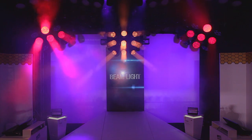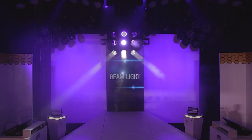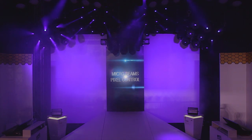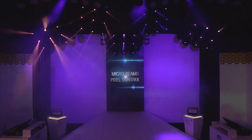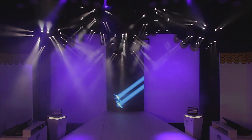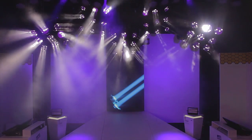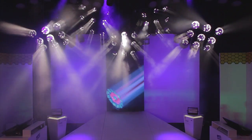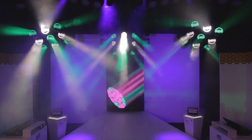However, the B-EYE is not just a wash light. When the beam angle is at its minimum of 4 degrees, the diffused wash mode turns into a concentrated narrow beam. As every single LED can be individually controlled, the light beam consists of a set of separate pulsating microbeams, each with its own color and light intensity. The shape of the light beam may be changed in mid-air with an attractive organic morphing effect. At the same time, you can create color images on the front lens, which transform the B-EYE into a fantastic scenic element.